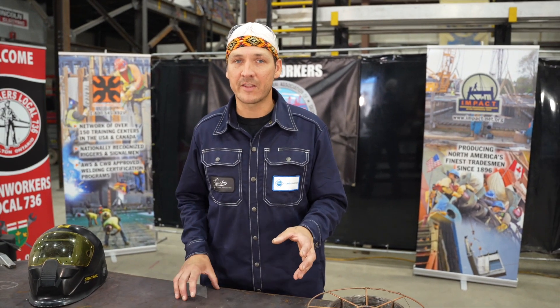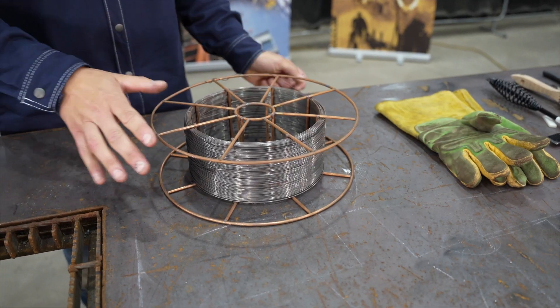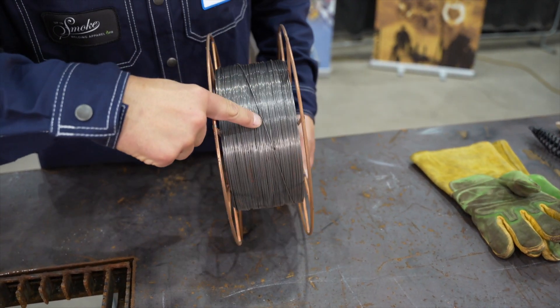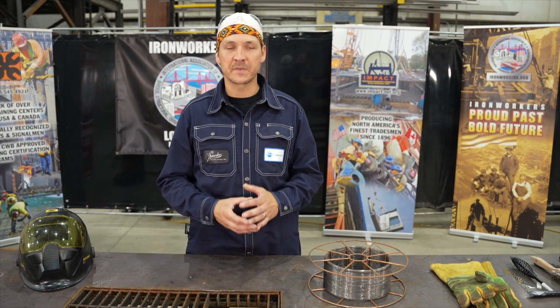The first cause of worm tracks I want to talk about is moisture. That moisture can be in your filler wire, it can be in your plate that you're welding, or it can even be in the environment or the shielding gas you're using. Most filler wires have a low amount of diffusible hydrogen. However, if that moisture gets trapped in that weld or underneath the slag while things are solidifying, you can have even more detrimental effects than just worm tracks.